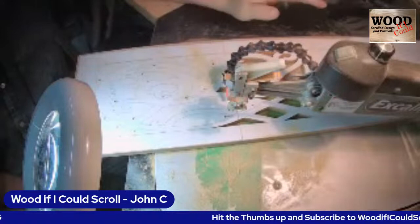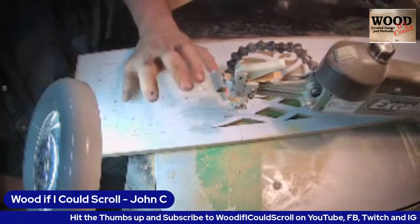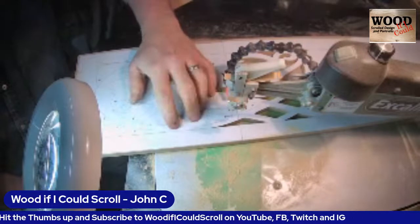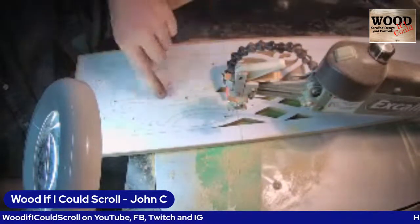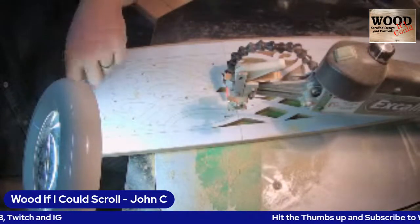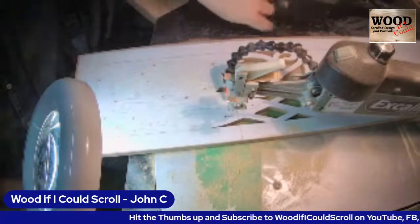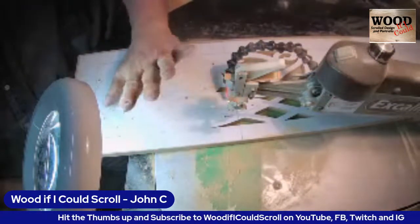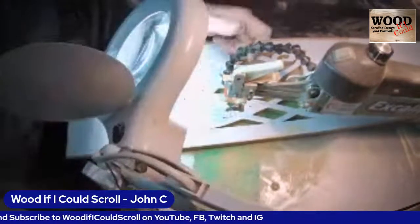Then he'll be knitting doilies. It's because this is only half. Yes, this is only half inch thick. So I'm going to make a backer piece that'll be cut out from the inside as well to make a double thickness wall on the edges. That way she can paint it and I'll round off three of the edges once I cut it down to size, and then she can paint it to match the trim in the house. That's going to look pretty awesome when you're done.